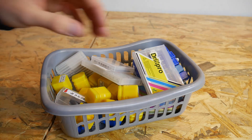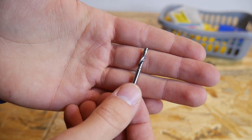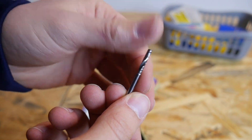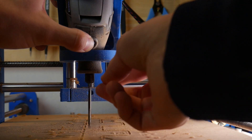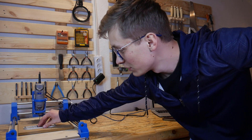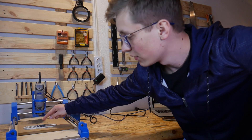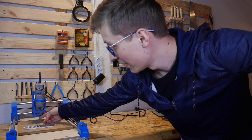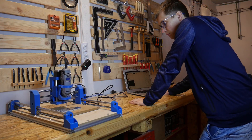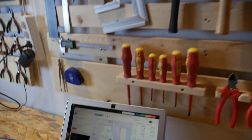I should also mention the bit I'm going to use — just like with the plexiglass, I'm going to use a single flute end mill. I will put a link in the description — there is just a single flute that cuts. Make sure that it is mounted rock solid — that's not wood, forces right there are way bigger, so we need to use screws and forget about double-sided tape. Right now we have to find the zero point — I already marked this point on the material, I just have to go to this point with the bit and we should be ready to start milling. As always, safety is number one priority, so remember about safety glasses and ear protection. Are you ready? I'm not, but I really want to do this, so let's start. Let's go.